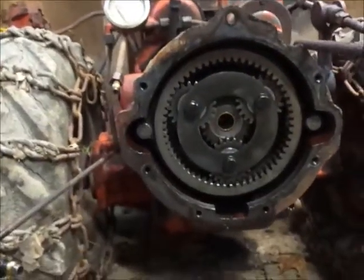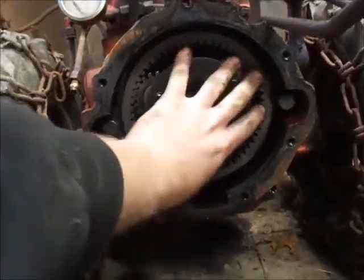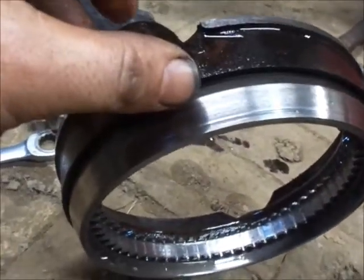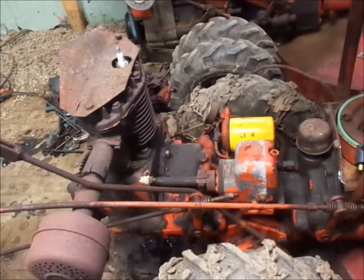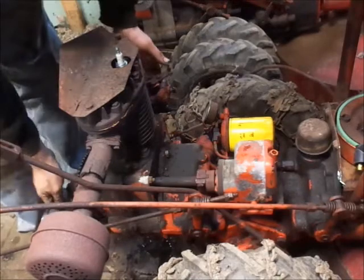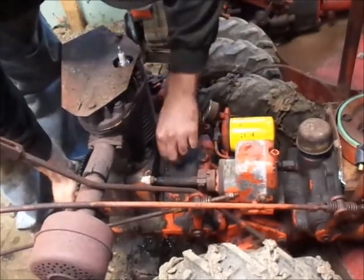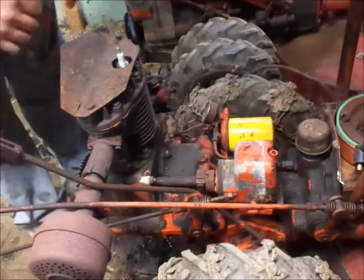Alright, all I gotta do is put the, call it the spacer backing plate behind it, because the pattern was actually good in there. It was right in the center of the gear. Just the center of it ain't there. So now at this point, you'll just slide the motor the whole way in. I find it easy to put the nut on the stud up top first.